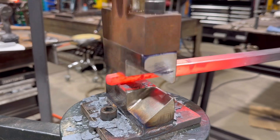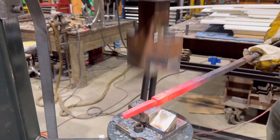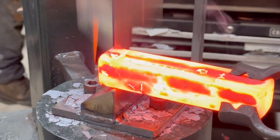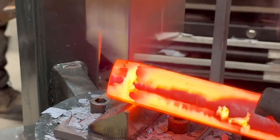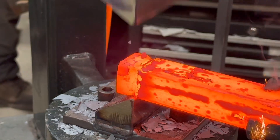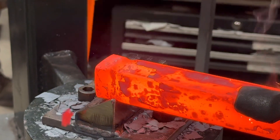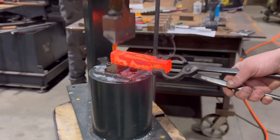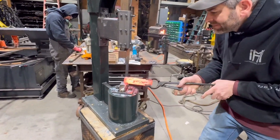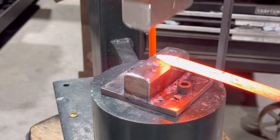We also made a pair of regular flat dies for this hammer and then a pair of drawing dies. It's amazing how good the control feels when you're using this hammer — it is really fast, which makes up for speed, though it lacks in hitting weight. It's only a 15-pound hammer. I did a piece of inch-and-a-quarter just as a test to see how well it would pull a tenon off, and it did really well. For that much mass on this small a hammer, it pinched it off and pulled it out really nicely.